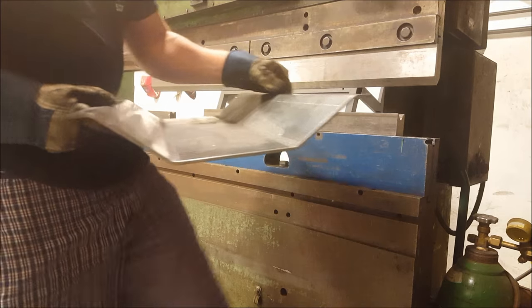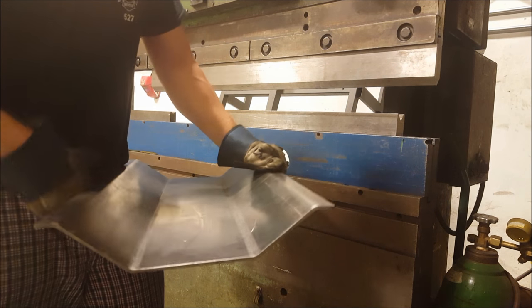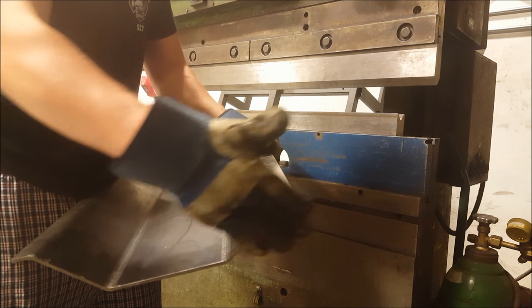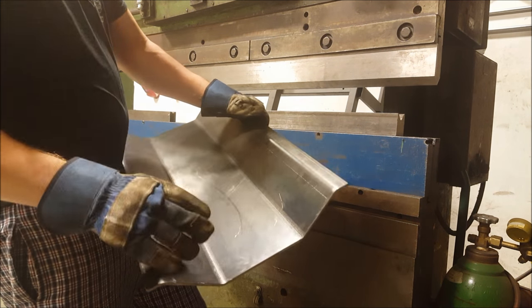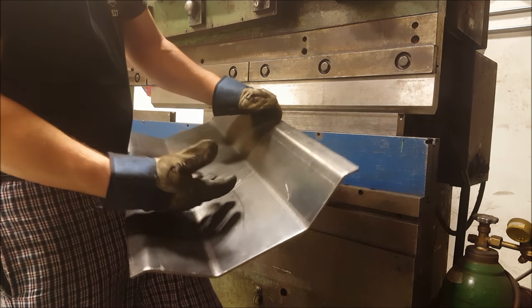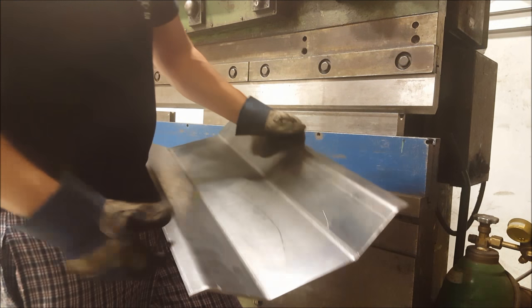This is the actual dip down portion of the forge. This is going to sit right in there. Basically, I'll have a big rectangular cutout, and this will sit right in. I'll actually cap the ends off first. And then I'm going to drill holes in here, and this will be where my coal sits. And then I'll have my blower underneath blowing air up through these holes.